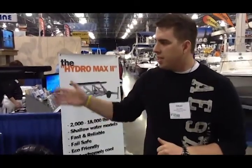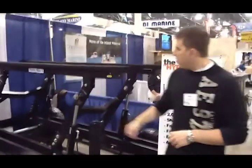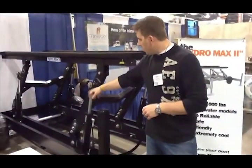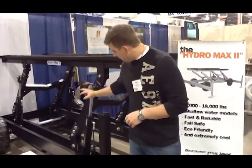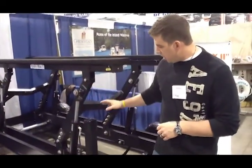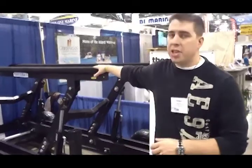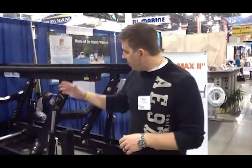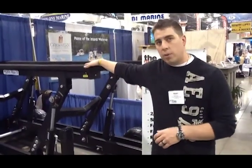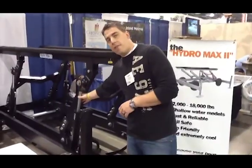What makes this lift different than any other lift out there, Isaac? One thing — if you look at our lift, it's one of the most heavy-duty lifts on the market, between the thickness of the metals, our frame design, and all the bolts: half-inch, three-quarter-inch, one-inch bolts. This one here has stainless steel. And when it's in the fully upright position, it's about 5 to 8 degrees past center, so when the bolt is on it, all the weight of the boat is on the lift frame, not the cylinders. So you get a longer life out of the cylinders.